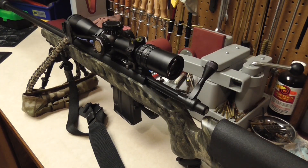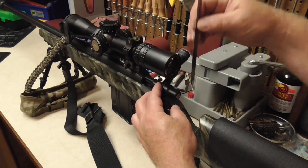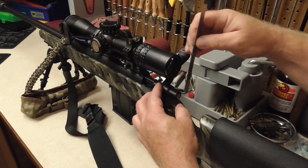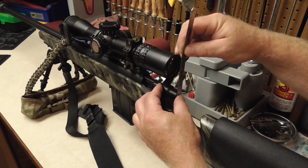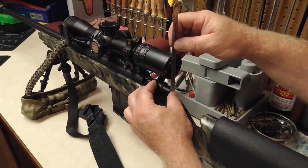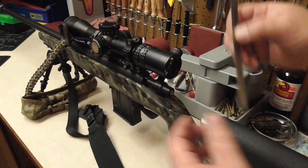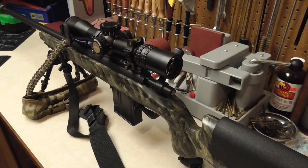One of the easiest ways to do that is just to eyeball the back of the bolt, take your 6-inch steel rule, eyeball the back of the bolt housing, slide up with the rule, and eyeball the back of the ocular lens to come up with your number. It can really be that easy — this is about 2 1/8, close enough.